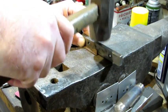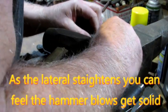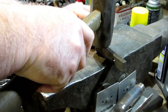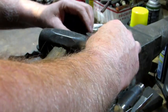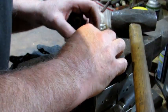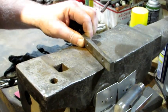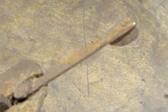Some firm hits with the hammer, then moving over to the other side and doing the same thing — nice firm hits with the hammer. I'm going to repeat that again: far side, then near side. Let's take a look at it — you certainly would not know that that is the same lateral adjustment lever. Here's a look at it, working from the side over to the top. The twist is out of it; she's nice and straight. And that's how you straighten lateral adjustment levers.